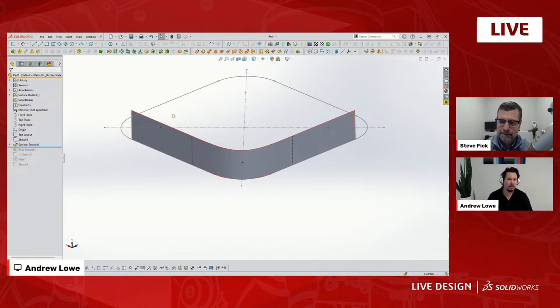And I don't get a situation where I have a very sharp transition, because as that metal is folded, that corner inherently becomes curvature continuous. And I would just be relying on the sheet metal tools. But if I was doing a stamping, I would want to have this controlled geometry and use that actual modeling. So it doesn't impact the manufacturing or the cost. It does impact the style of product that you're looking to have. Okay. Sometimes you want to have those sharper transitions.